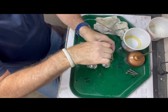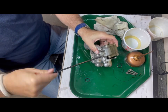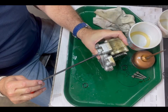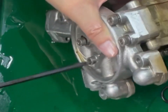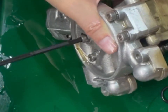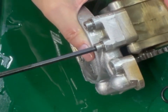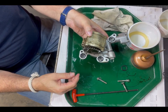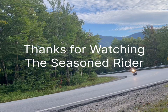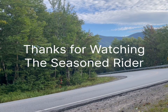Hey, it's Chris from the Season Rider. Thank you for checking out this episode on the oil pump refurbishment — hopefully it's both entertaining and useful. We won't actually know if cleaning up that one-way check valve, that stops the oil from dumping out of the tank back into the sump, worked until the motor is run and turned off and we check the oil level. So hit subscribe to come along for that ride. Another project that should have taken an hour but actually took three days — that's the story of my life at the Season Rider. Thanks for watching, please hit subscribe, appreciate you all, have a good day.